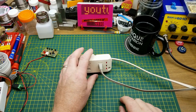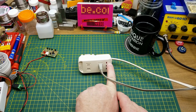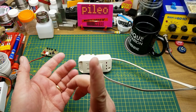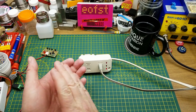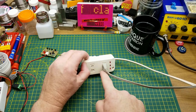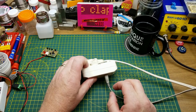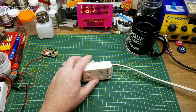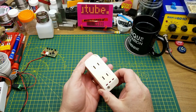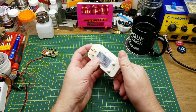If you watch the LEDs on it - that one detects sound, and those two show the relays. You can hear the relay click for the second one for the two claps, and there's the other relay for the three claps - but it didn't do anything. I'm thinking that little relay is broken in there.